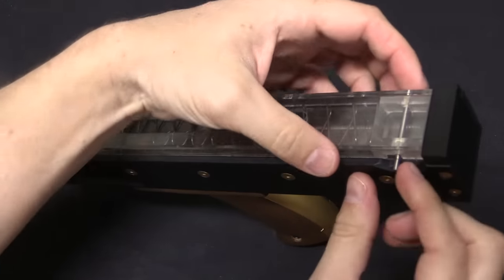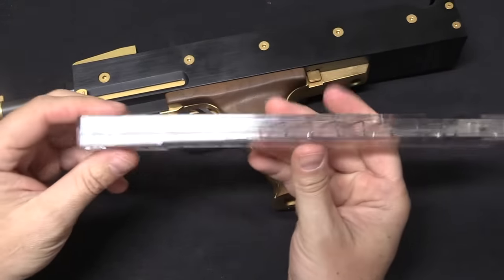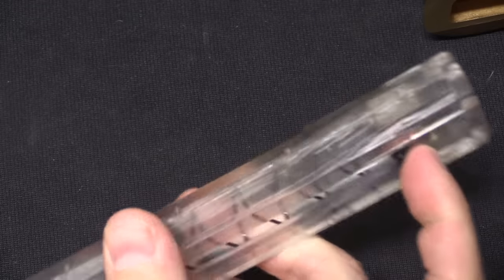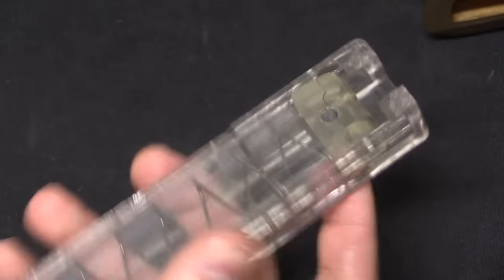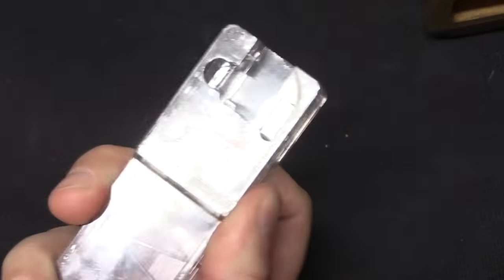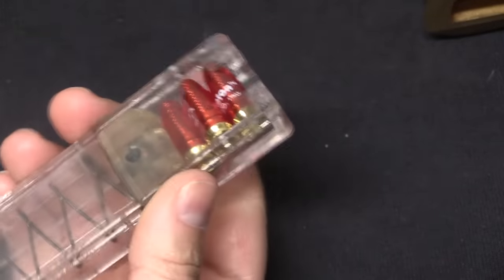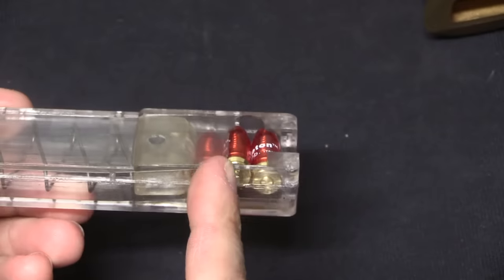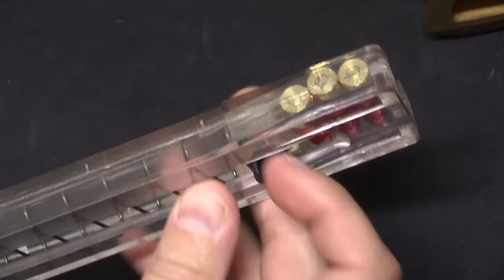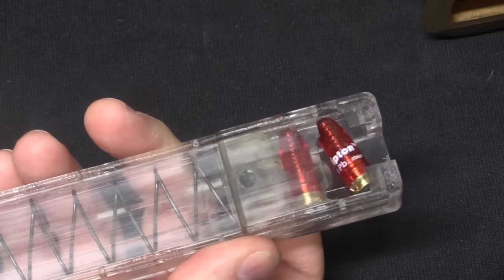The magazine is the cool part. Pull this latch forward — it's just a little spring catch — and we can take out the magazine. It is a single-stack magazine, the whole thing made of clear plastic. One of Hill's ideas was that this could be fed from basically pre-packaged, single-use magazines. There is a cartridge-shaped hole in the bottom of the magazine, so you can drop in cartridges. When the follower is all the way forward, the first cartridge goes past that opening so ammunition doesn't fall out when the magazine is not in the gun. When you put it into the gun, a little stopper pulls the follower back slightly, which allows the cartridges to line up to feed out of the magazine.